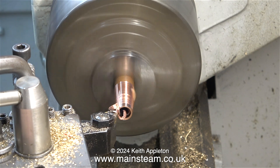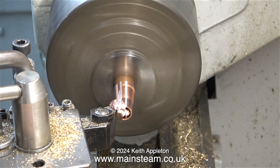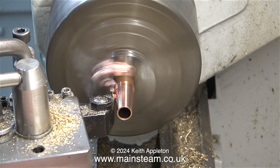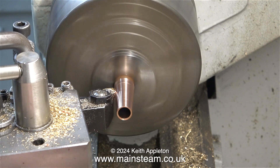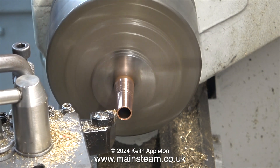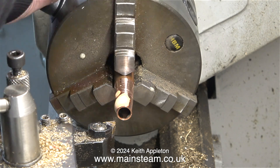In this clip I'm using a more suitable cutting tool, but unfortunately, given the angle of the top slide to turn the taper, it's not in the right position and it's removing far too much copper at every pass, although to be fair the finish is okay. Not so good when I come back the other way, and it doesn't sound good as I'm cutting the metal.